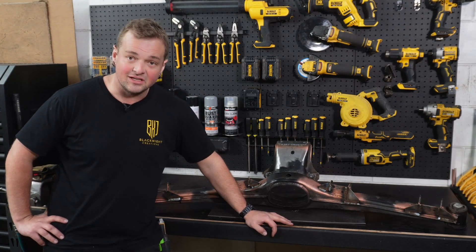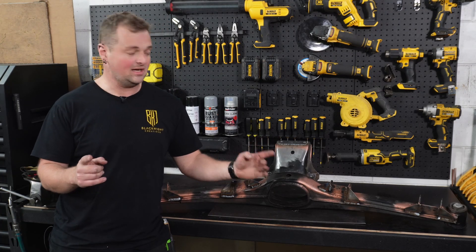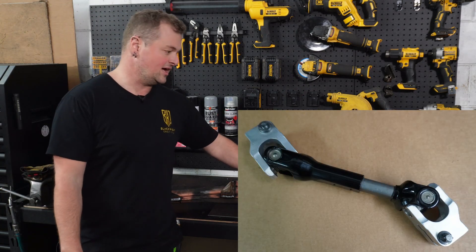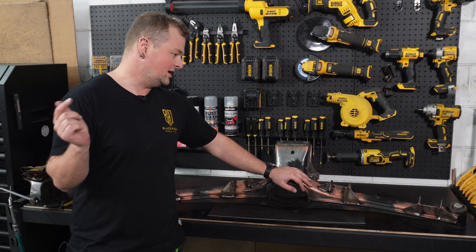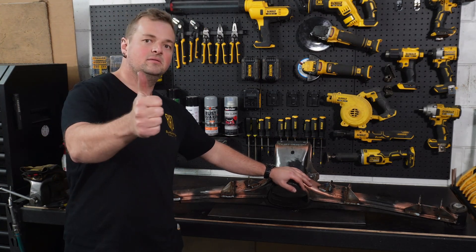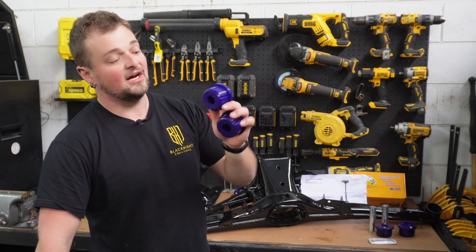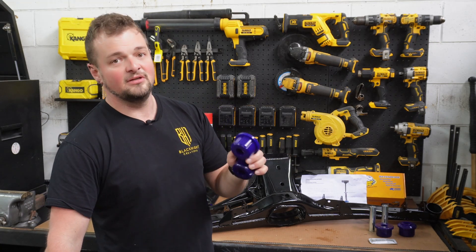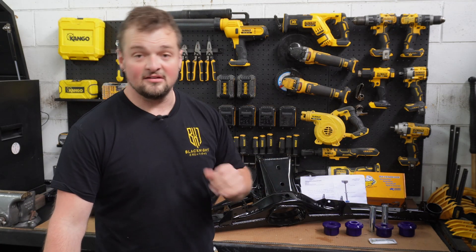I didn't have to wait for delivery, I didn't have to pay for shipping, and I've still got probably a meter of flat bar left. Really it's like 500mm of flat bar and you can reinforce this subframe. I'll remove the bushings — we're going to paint it the same color as the steering linkage, and all of the subframes are going that color. I really like that color. We'll get this off to sandblasting, get it primed, work out the bushings, and then get it painted. The next step is to decide what bushings you're going to go with. I'm going with SuperPro bushings just because they are incredibly easy to install compared to the OEM versions. OEM is always going to be a terrific option — I just didn't want to go with it this time. I'll leave a link in the description for the bushings I've used so you can decide for yourself.